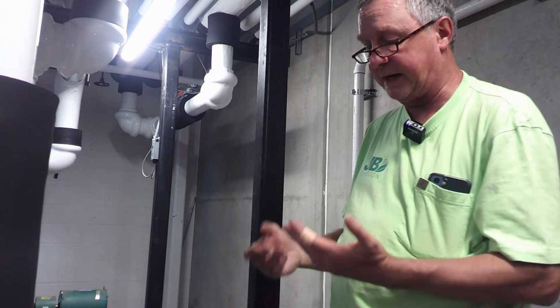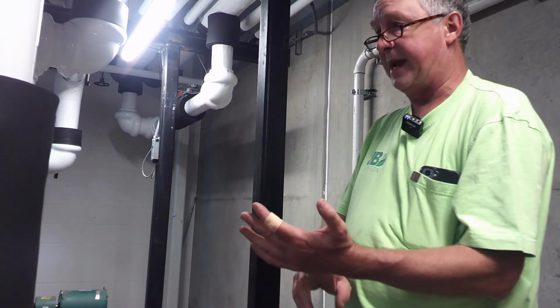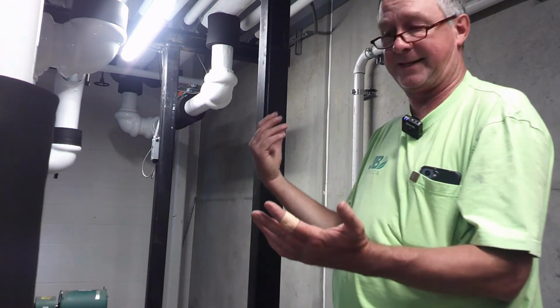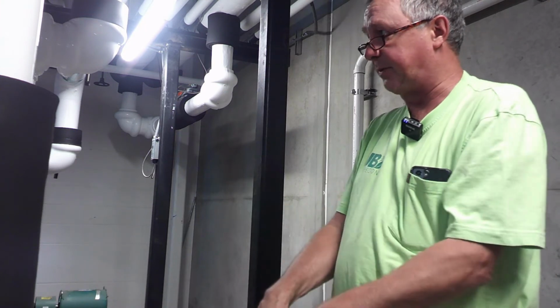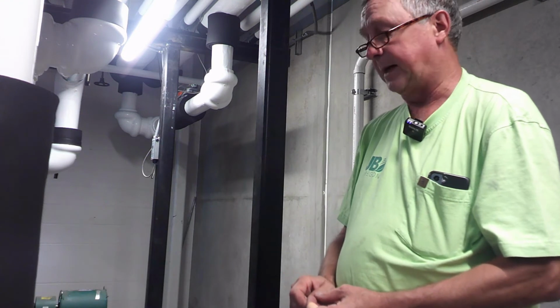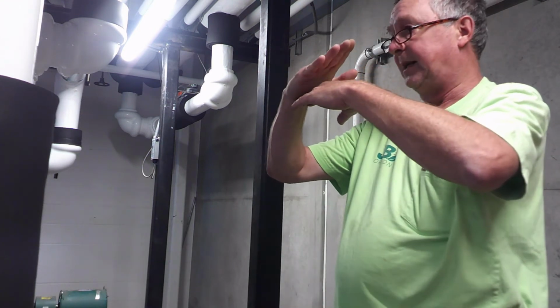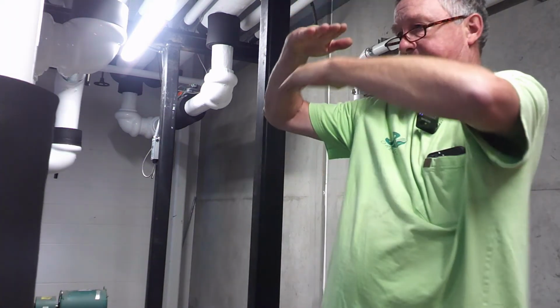When you go to put the seal key in, please wash your hands before. Never touch the seal face. Never, with your fingers. Don't use the red linen rags. Just don't touch them. It comes with a little cardboard disc. That's what I use to push it into the suction eye part. And you can usually tell, just make sure it's seated properly. If it's in there, you can tell it's cockeyed. Don't think, oh, that's going to be good enough because this is going to push that down. It's got to be flush.